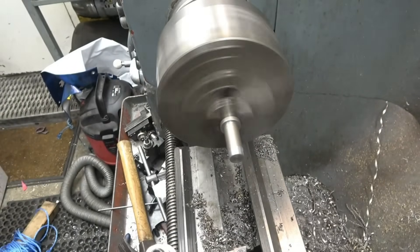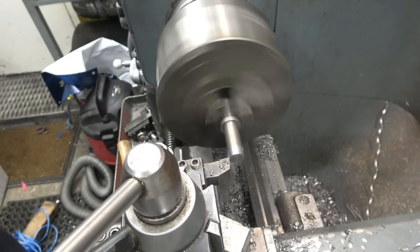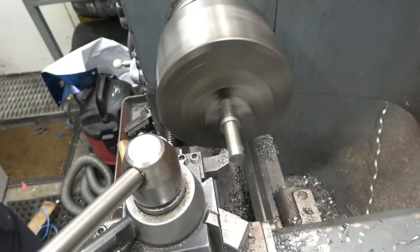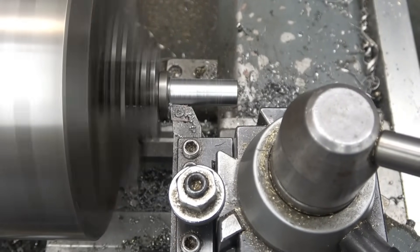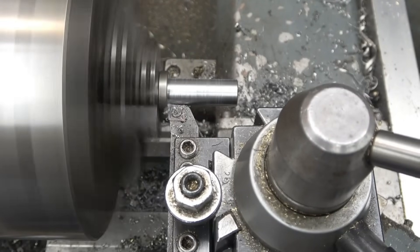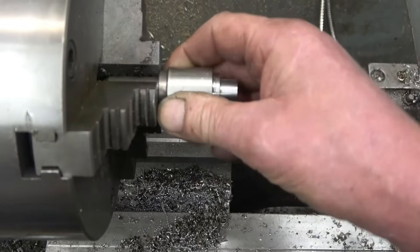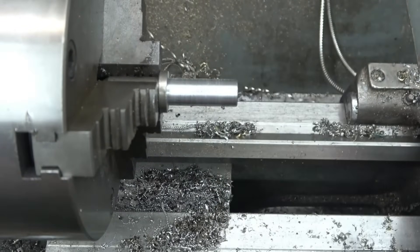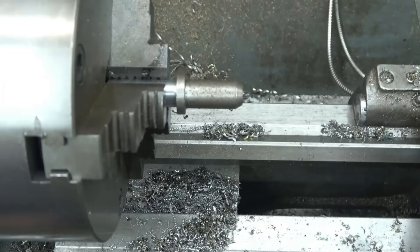It's on the tight side — just a fraction more. Right, that's it. I don't actually need that much length so I can take a bit off the end of it — it just needs to be the length of the bush, no more no less. Although it wasn't hard to leave that length in case I've got a thicker bit of material to do. Just part the other end off, and then that's the bush done — just need to put a machine slot into it.